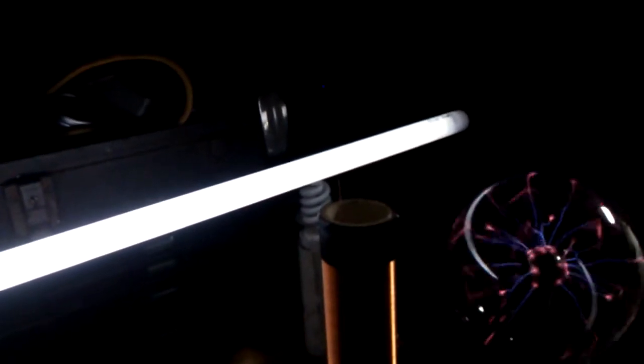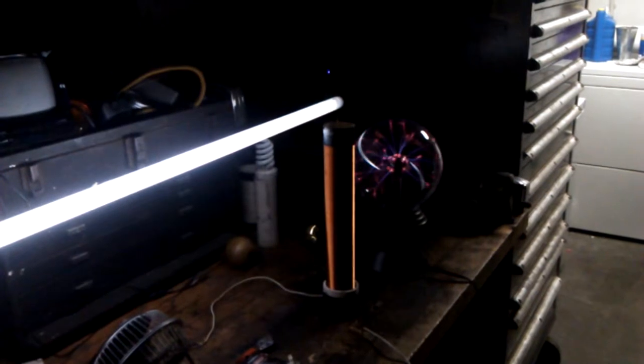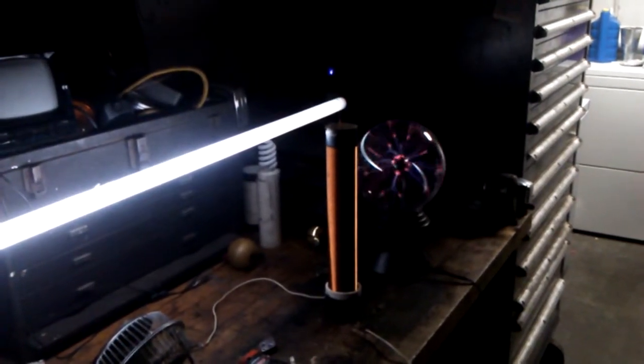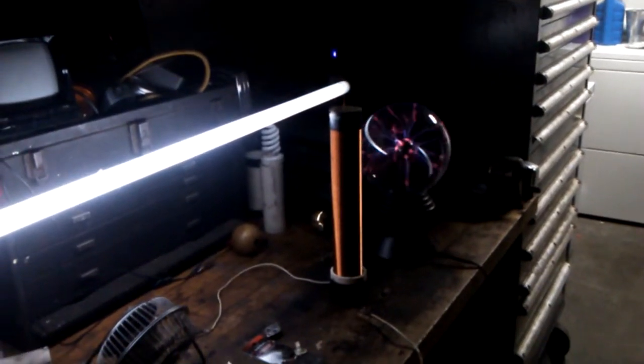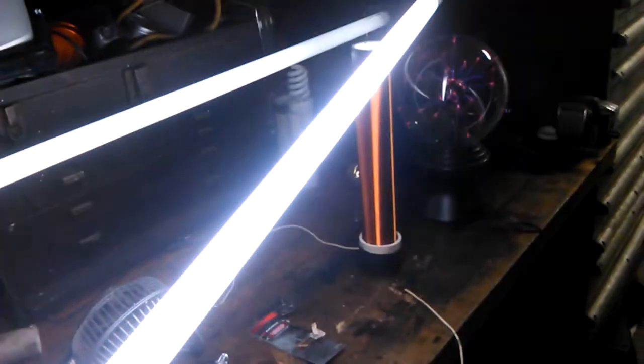As you can see, I've got a pretty good plasma brush. Try not to get too close because it does shut the thing off. Let's turn this down to about 7 to 8 volts — and we have just a tiny bit of breakout. Now I'm going to turn this way up — I'll stand a little bit farther back because this phone does not like EMF. And that's about 60 volts on the variac. You can get this other light to light up — it is very, very bright, at least 100% brightness if not more.